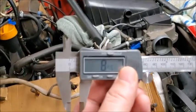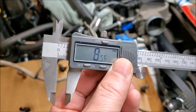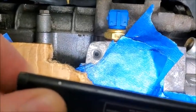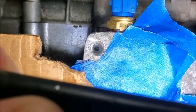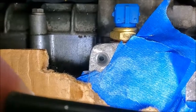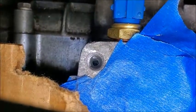From the previous video, we are starting out at 8.56 millimeters — so that's where we're going to start. All right, success! I got down and through the bolt. You can see the hole in the bottom there — that's where the bolt ends and the hole continues, which was drilled into the block originally. Now all I've got to do is work on cleaning up the sides. That hole looks almost well centered, but I've just got to get the rest of the sides cleaned up and smoothed out and get it ready for the insert.